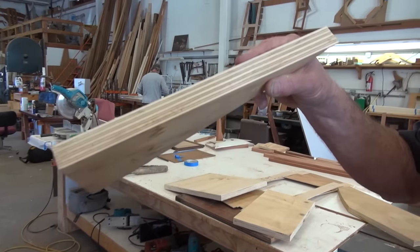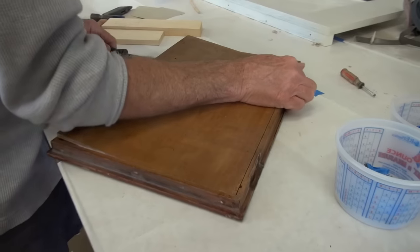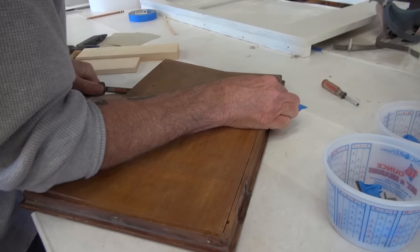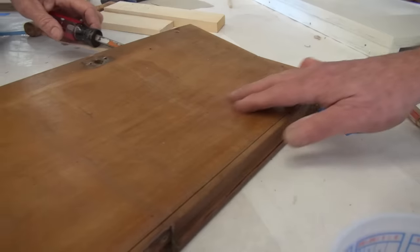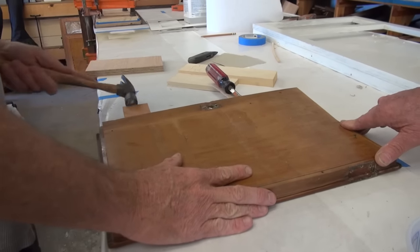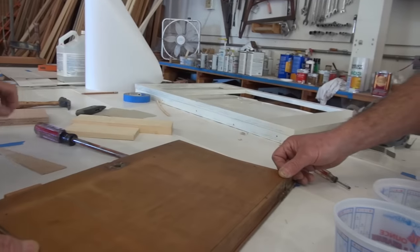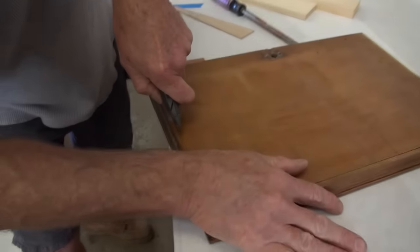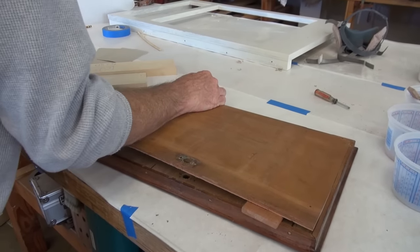That's good plywood — made in Texas. You can feel the little edges in the corners lifting. It's the same old story: if it's lifting here and there, you want to try to get it completely off instead of forcing the glue down there. It's stuck in the middle but not on the edges. If you just wedge it, the glue will slowly let go. We can hear it creaking. But the good thing is we don't have to make any new panels — it's plywood, it shouldn't crack.